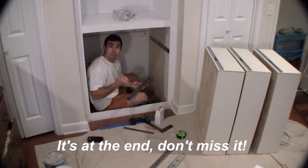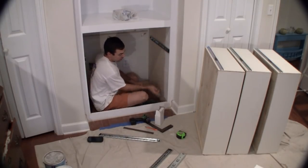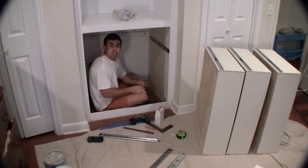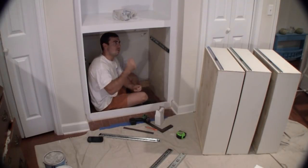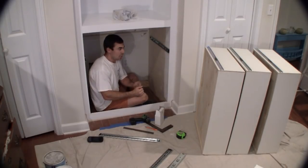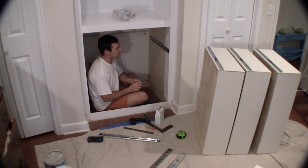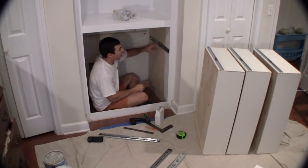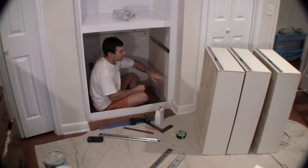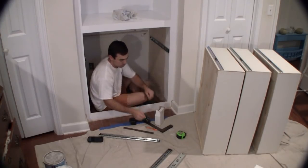Right now, what I'm doing, I'm installing my drawer slides down here, and I have gone in here and I have laid out the correct spacing according to the size of my drawers to hopefully make my drawer fronts where they can all be the same size. I'm kind of playing with a lot of math here, so hopefully I'll get it right. But what I've done, I've marked the center line for my drawer slides, and I have squared it off with a line back, and I go ahead and put the first screw in,